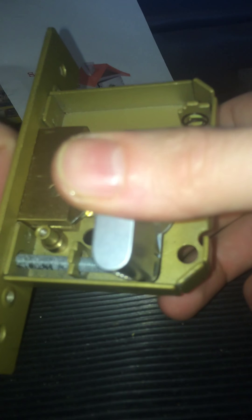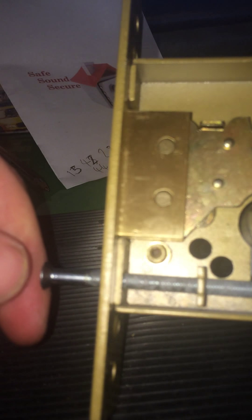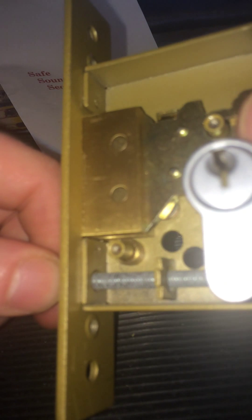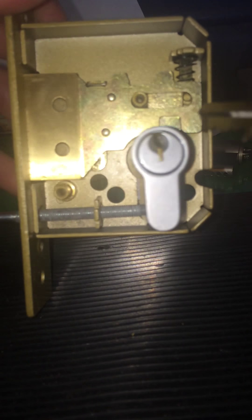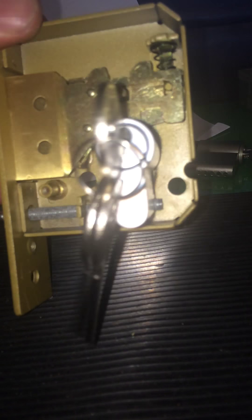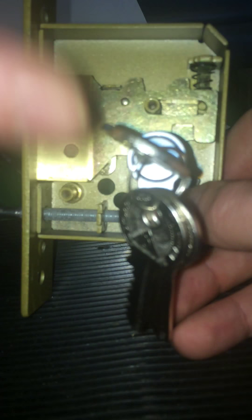All you need — when you do this up, you don't need the tie screw coming through and hitting the back of the lock. You just want to do it enough so this goes flush on the front here, and you get a good grip and it will keep the cylinder steady. And then you just put the key in. See the cam — the cam is going up, it's going to lift that piece there, and because I'm not holding the lock it goes up.